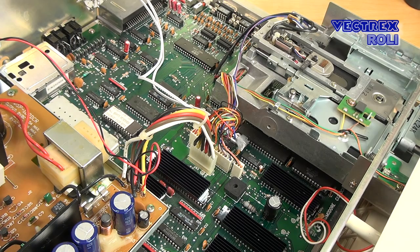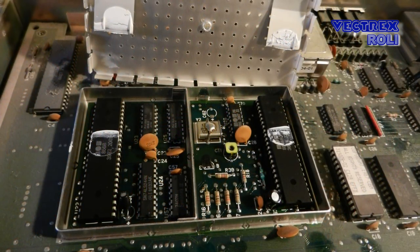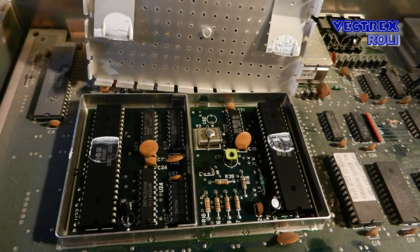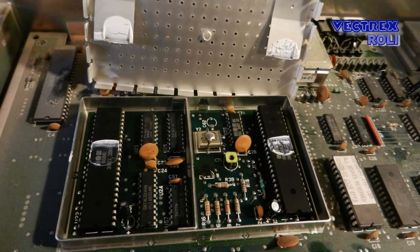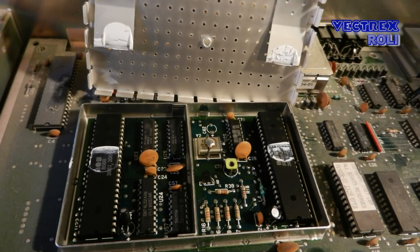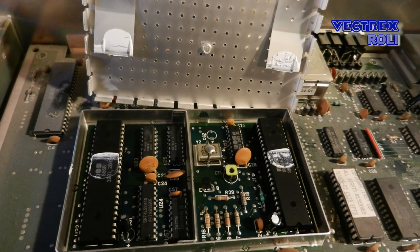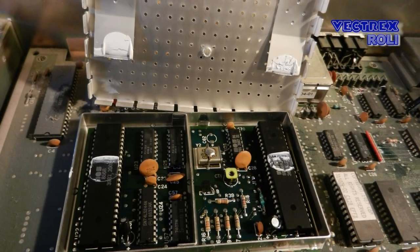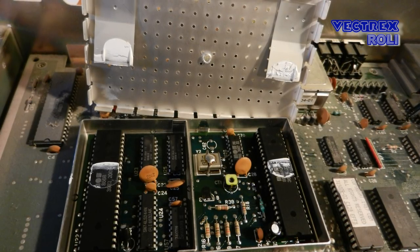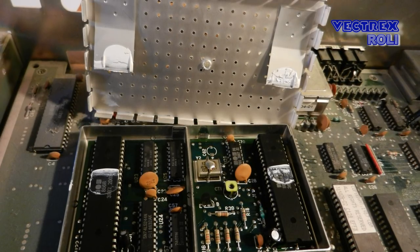find it always a bit boring, but here I show you the two separate graphic chips, one for the 80 column mode using RGB output and one for the 40 column composite video or SVHS component output. You can find them in separate metal boxes on your PCB, and the top cover of the shielding boxes also take care about cooling the chips. So I did clean the chips, put in new tiny caps also on that part of the PCB, and I put a modern high-performance thermal compound on top of the graphic chips.